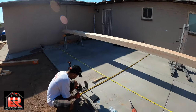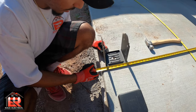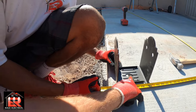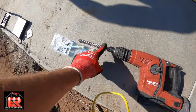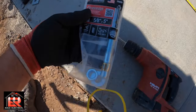We've got Nate measuring — 166 and a half inches. We line it up with that bolt there. We're using a Hilti with a 5/8" bit and a 5/8" by 5-inch wedge anchor.